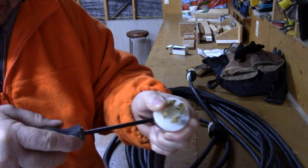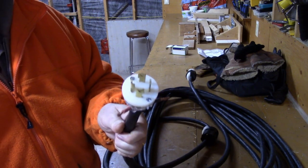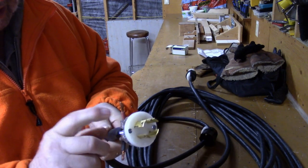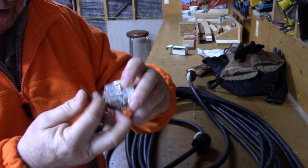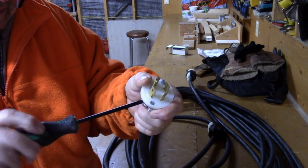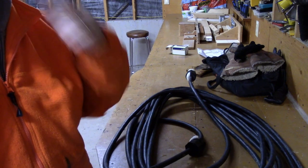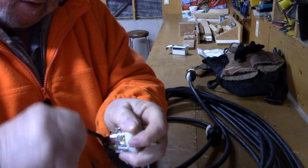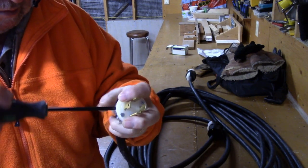There are a lot of turns there because I had opened those screw terminals up to their widest to make it easy to get the wires in. Now the black and the red - they're both the 120 side of the 220 volt feed, so it doesn't really matter which one you put where. Sometimes there will be designations marked on the plug like X and Y, but it's not that important for a generator in a house. So I'm going to put the red one right up in there and tighten it, then put the black right up in there and make sure no wire is sticking out.